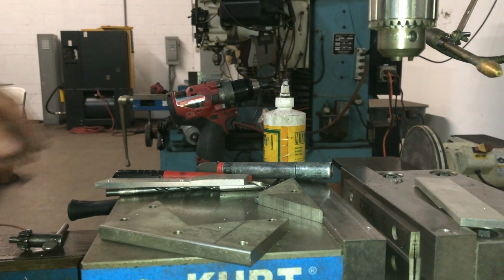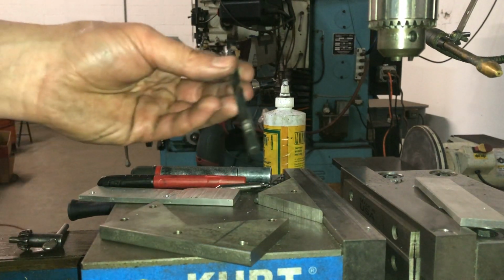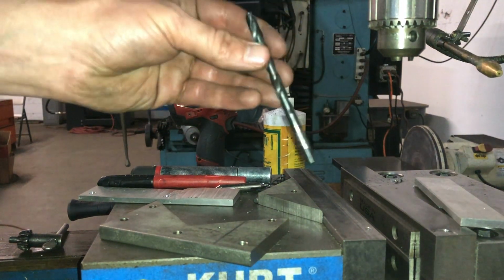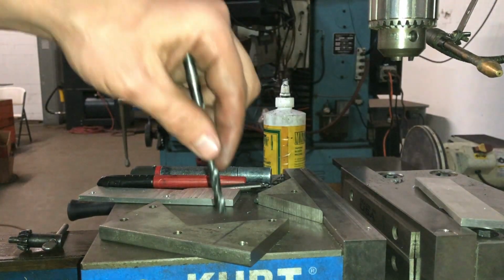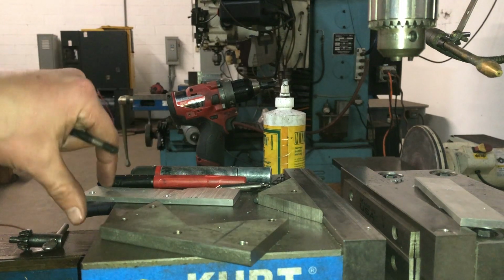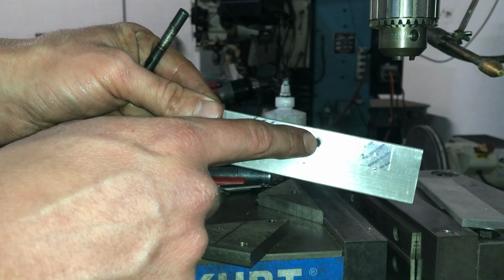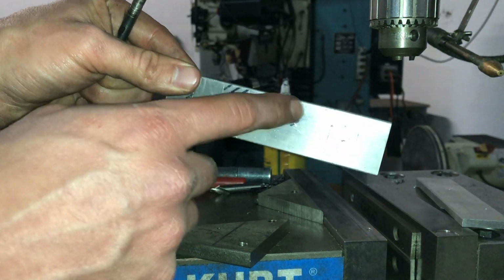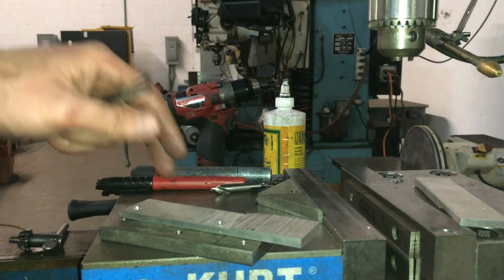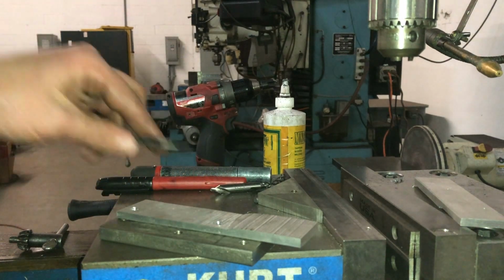So now, let's see, where's all my stuff at here? Now I have a 265 thousandths drill bit, so I think it's a 17/64ths drill bit. This will be my through hole so that the quarter inch bolt can go right through this material. Then I can go back and run a quarter-20 tap through the aluminum piece to make threads into it. With the through hole, bolt it up together and then mill off the top side and make it flat.